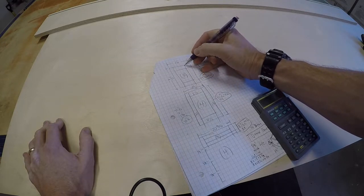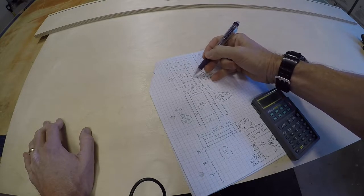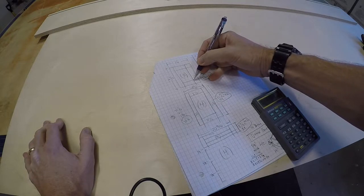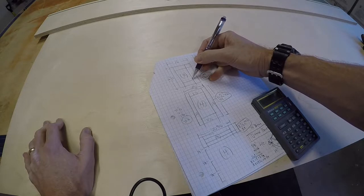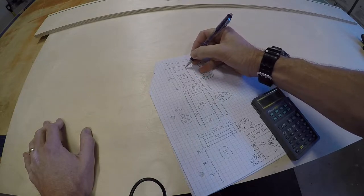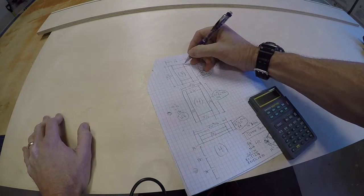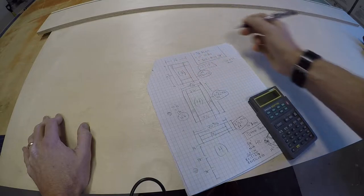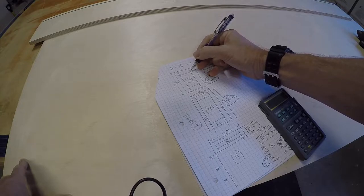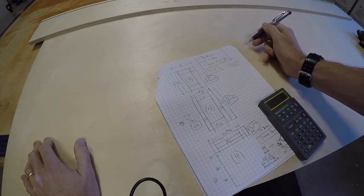The horizontal parts get what are called coped tenons on each side. And the stiles get what's called a stick joint. Essentially, that's the one with the profile. And the profile also goes on the rails as well. But on the ends of the rails, that's where that cope goes. And it actually sticks into the stiles a little bit. It's like a little tenon that sits inside the groove of all the parts. So we need to figure out how big to make everything.